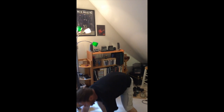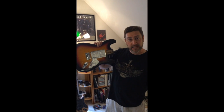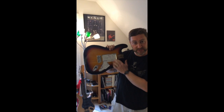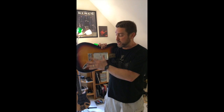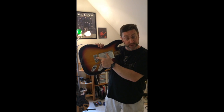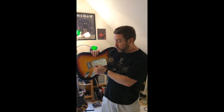All right, here's a body. It's some no-name Strat-looking thing. Last night we got these suckers home, and I shielded it with aluminum foil tape, which gives it some RF shielding to block out any radio frequency noise or extra electrical noise. Makes the guitar quieter. I'm sure hoping this bridge is something good. It appears to have wiring to the jack, and I have a ground wire. So then all I need is a pick guard.